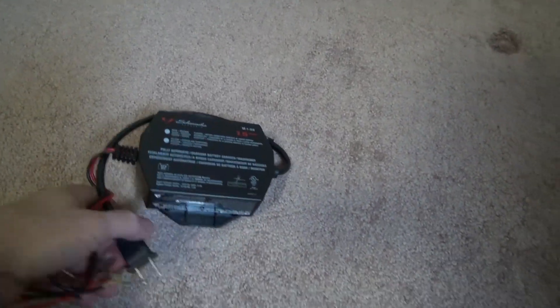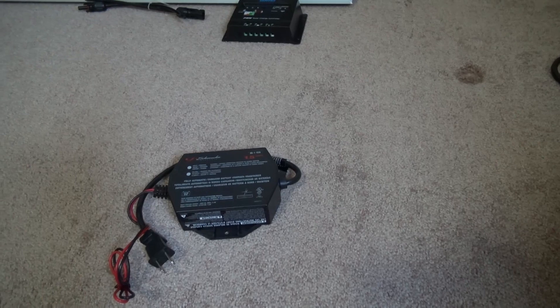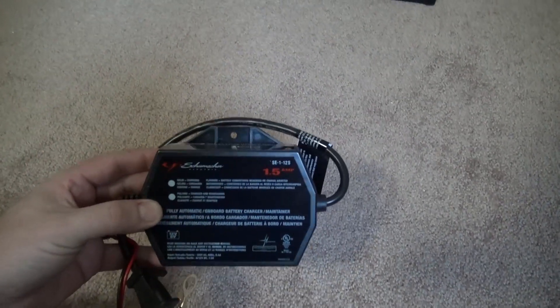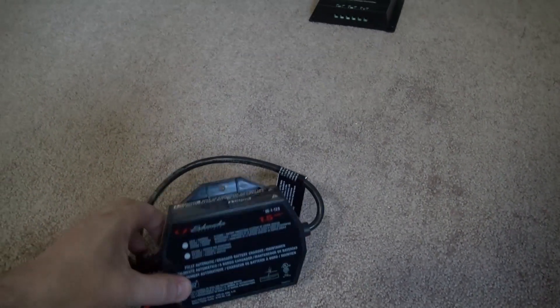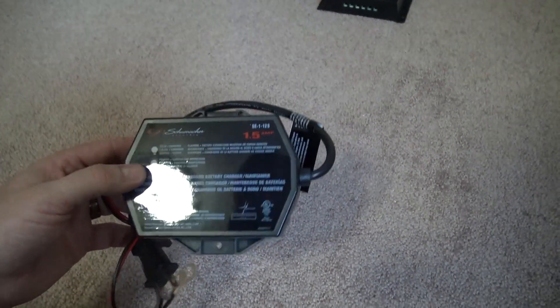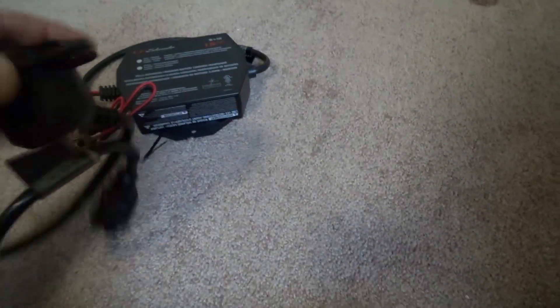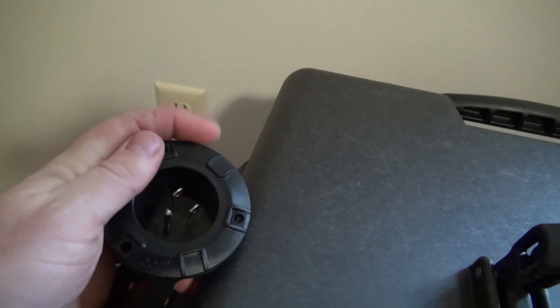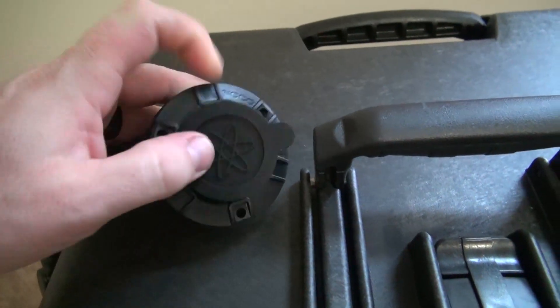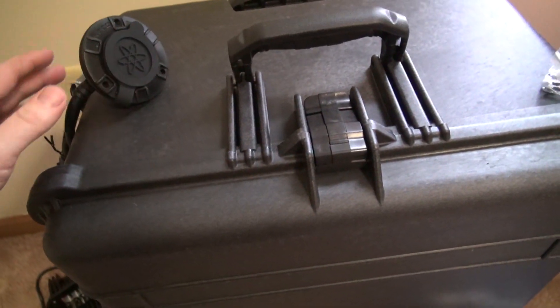I also wanted to be able to charge our system off of standard AC power — this would be good for just keeping it topped off when it's in storage, or if you just want to charge up your batteries and don't have a place to set the panels out. So we picked up a one and a half amp battery maintainer slash charger — just a trickle charger. It will charge very slowly, so it won't be the best if your batteries are highly discharged, but it will bring them up slowly and keep the batteries at a healthy voltage for long-term storage. I also picked up what I believe is the NOCO Genius brand inlet connector — once this is threaded into our enclosure it'll fit flush, and an extension cord will literally just pop right in. The goal being that if you needed to take this in an emergency, all you'd have to do is pull your extension cord out, close up the boot, and you're waterproof and ready to go.